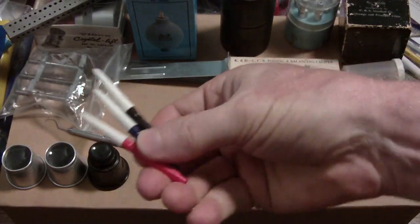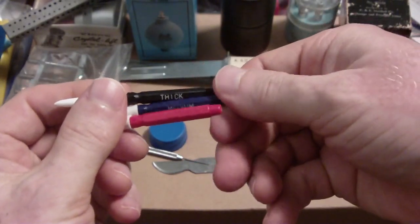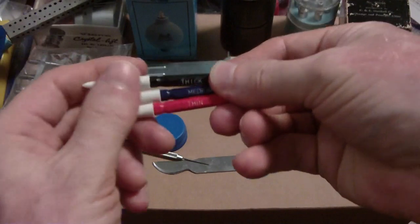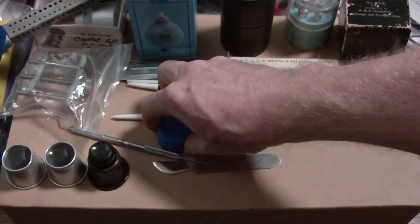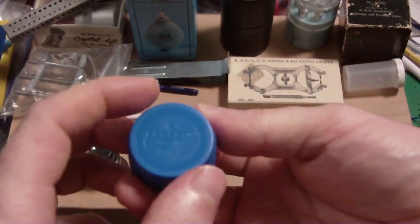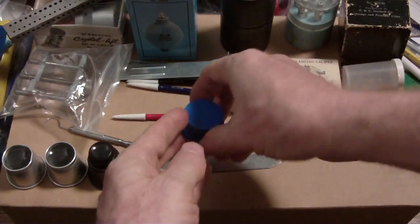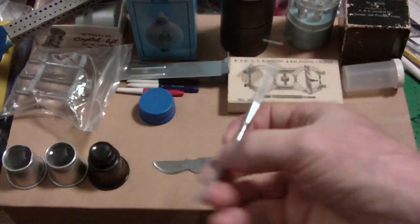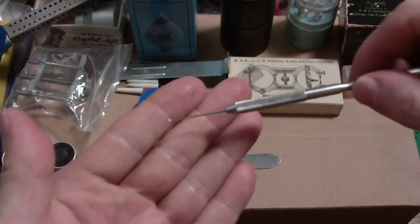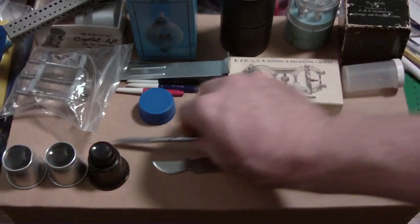Here are the oilers. After I take a watch apart I clean and oil it. I've got thick, medium, and thin oilers — thin for wristwatches, thick for bigger stuff. And I have the Bergeon Swiss oiler, which is glass, with oils inside. I also use a dental probe when I'm fitting plates back on and need to move wheels around to line up the pivots in the jewels.